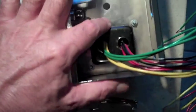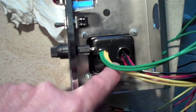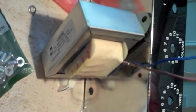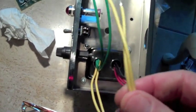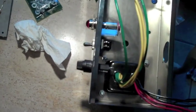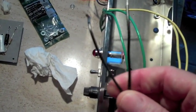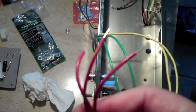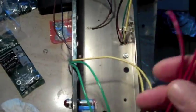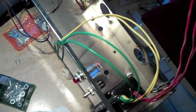Here's the Mojo 760 power transformer, and this is a Hammond 125 ESC. The green wires provide 6.3 volts for the heater filaments on the tubes. Yellow wires provide 5 volts for the rectifier heater. The black wires are where 120V AC home voltage comes in, and the red wires are where 330 volts of AC comes out — that's what the power transformer does, 120 to 330. Then this goes into the rectifier tube, and that turns it into DC voltage.